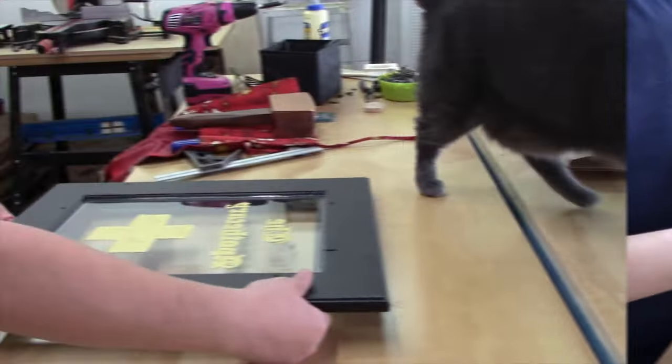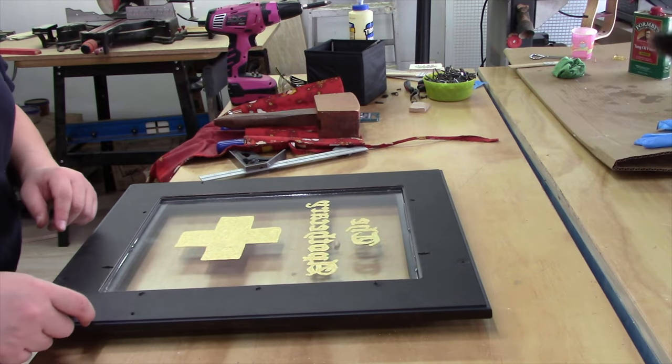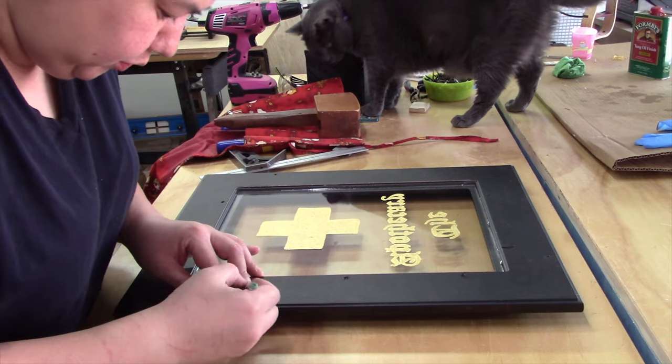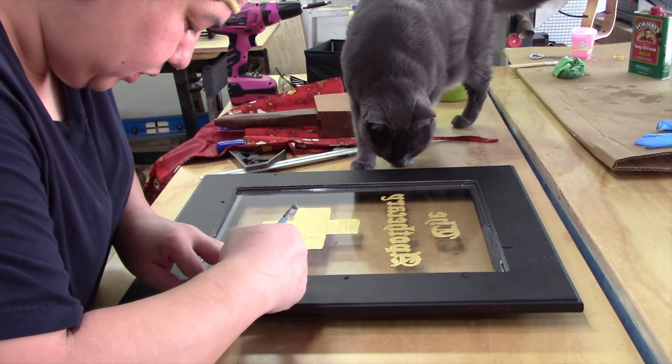And there we go. Even if you don't want to chisel through your wood, just remove the mat board — I'm going to do this with a razor blade. All I'll be doing is pre-drilling a tiny hole and driving in the screws that came with the kit, and my lid will be on.